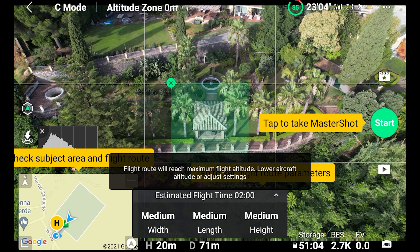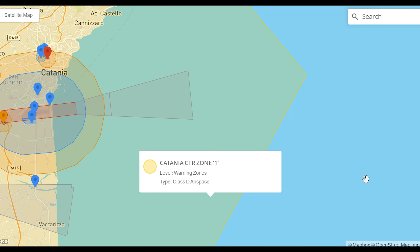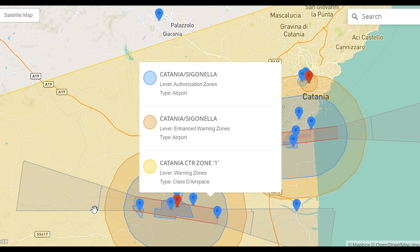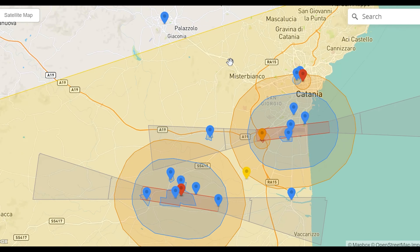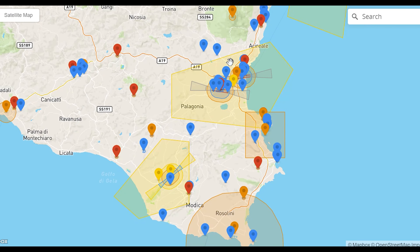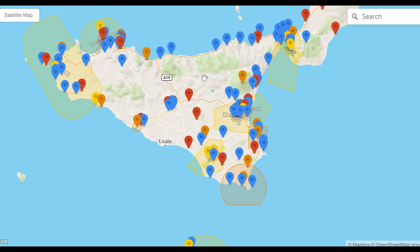So I took my trusty bicycle, went a couple of miles farther, just outside the warning zone, and this time things worked out perfectly. Warning zones don't have to be confused with authorization or restricted areas — it is perfectly legal to fly within a warning zone. For normal video or photo, the flight is allowed by the geofencing system, while in restricted or authorization areas the drone would not take off. This is probably a mistake in the DJI Fly app that I hope will be fixed by upcoming software upgrades. In the area where I live and in most areas in Europe there are warning zones everywhere, so the possibility of using Master Shot is severely restricted.